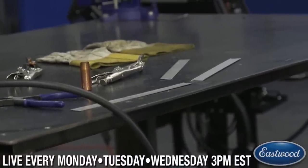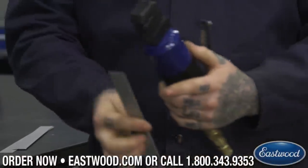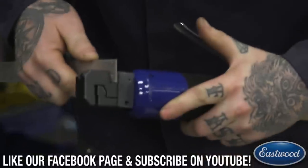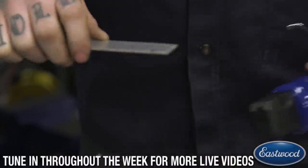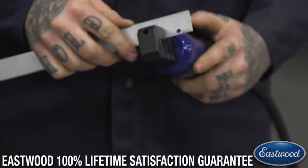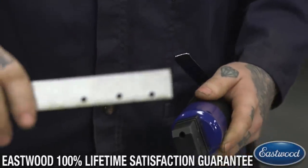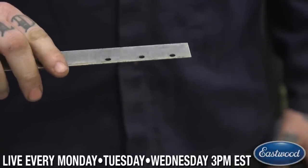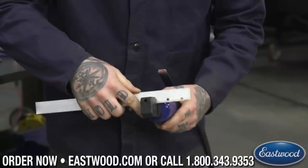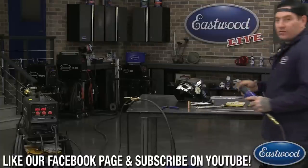It's really quick. If your panel's cut straight, you can get the same distance every time you drop it in. I'm going to put it here and just punch the hole — that quick. If your piece is square and you hold it square, you can do your top holes very quickly and you can see they're right there at about the same depth. If you want them perfectly dead on, you can draw a line right on it. They only come off a little if you don't push it all the way down or if you angle it slightly.